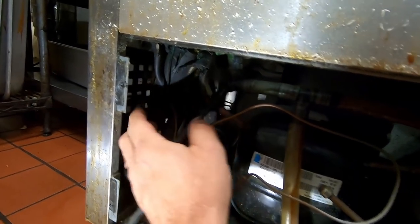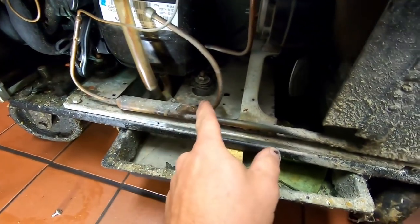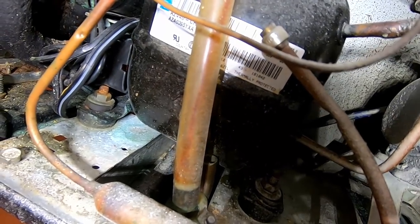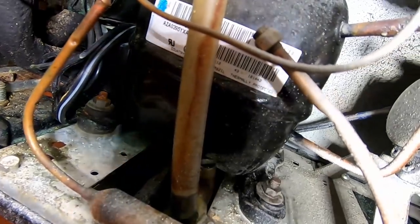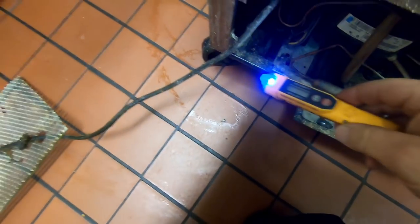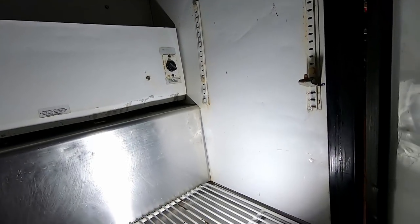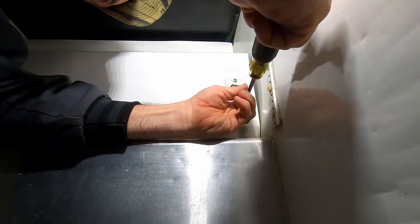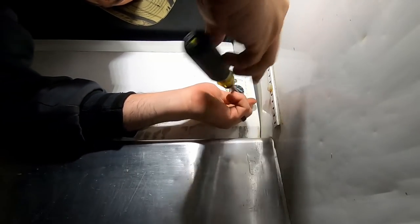The capillary tube looks like it's been pulled out. It looks original though — we don't usually use these type of filters. Oil looks pretty clean, that's a good thing. I'm going to check to make sure we've got power to this thing. Now I've got my ear in here — I can feel and hear the fan running. So there's a good chance the thermostat's junk. I'm going to unplug it and jump it to see what happens, with the power off — it's not a good idea to do it live.